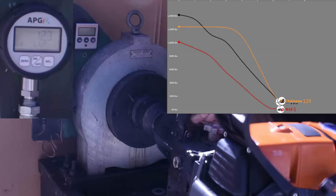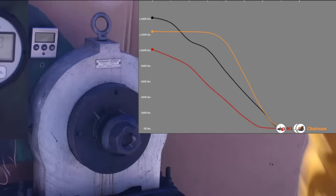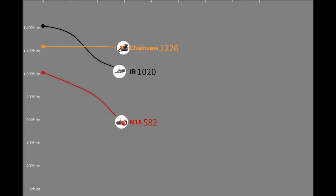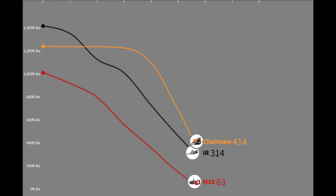So for one, can it remove 1,200 to 1,300 foot-pounds? Yep, no problem, in 6 to 7 seconds or so. Its curve is also odd looking. This is a sign of a weak sauce hammer spring, or at least weak compared to the engine that's behind it now. Not making big force per blow gains, but slapping the ever-living heck out of it with 13,000 RPM eventually does get it to move.